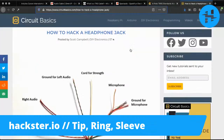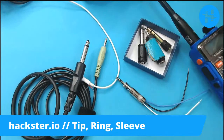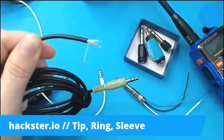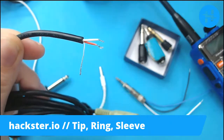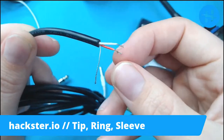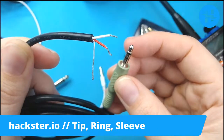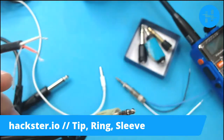And then there's another cool link below that's about how to hack a headphone jack that shows you vaguely standard coloring for wires. But then again, what we have over here is an audio cable with one end stripped. And I found a site that said a standard is that the left channel will be green, the right channel will be red, and the ground will be bare copper. And I was like, oh, that's handy. Right, red, ring. Right is usually connected to the ring on the jack. But no, alas, in this case, the red one is connected to the tip. So that is wrong in this case.